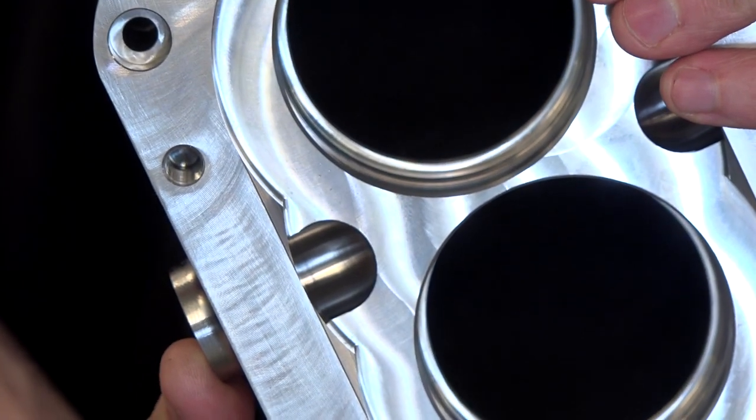What about the precision you're getting from the machine? You're doing some circular interpolation, and instead of tapping holes you're using thread milling — there are quite a few changes in the process compared to how you were doing things before. Yeah, we've gone to thread milling rather than tapping purely because the billets are not cheap. If you break a tap in a billet it's a pain to get out — thread mill goes, blow the hole out, put a new thread mill in. It's more cost effective doing it that way. And is the circular interpolation maintaining tolerance?